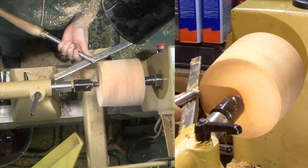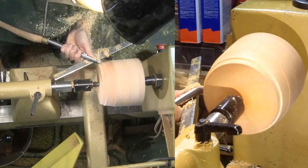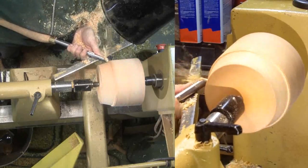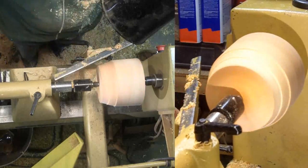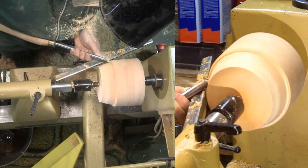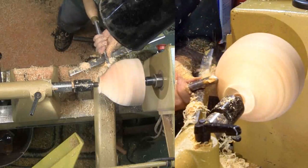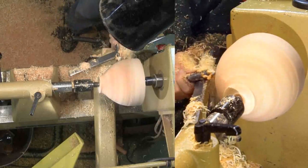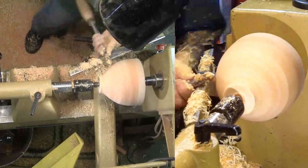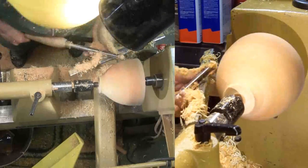For the exterior, I'm holding the gouge with the bevel pointed in the direction I want to cut. My thumb is in the flute. My fingers are wrapped under and around the gouge, putting pressure directly downward. My right hand is at the back of the handle, controlling the angle of the bevel, the angle of the gouge, the openness of the flute, and the pressure to make the cut. I'm still practicing getting my gouge to cut smoothly and evenly. I'm improving, but still a ways to go.